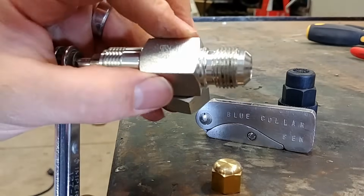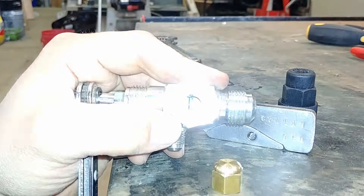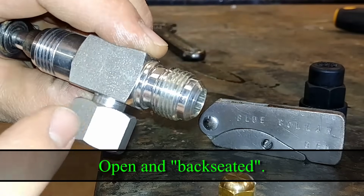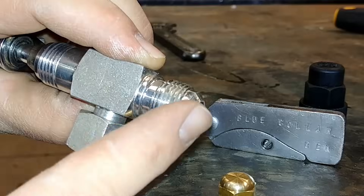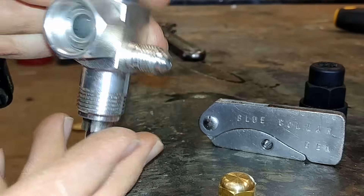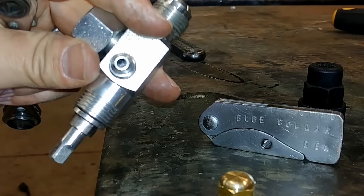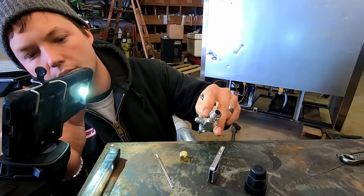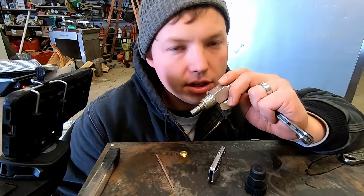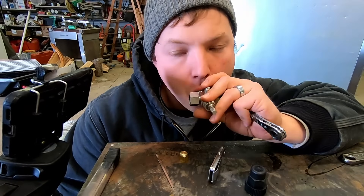Now before I do that, we're going to look at what position this thing is in. Right here if we look inside we'll see that the valve is currently in the open position, so right now air or refrigerant can transfer through here. This side is open, but this port here is closed — right now we cannot get any air through that. My cheeks bulging out means that it's closed. So I can't blow any air through there right now, but I can blow air through here just fine.